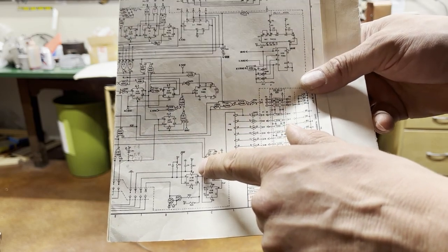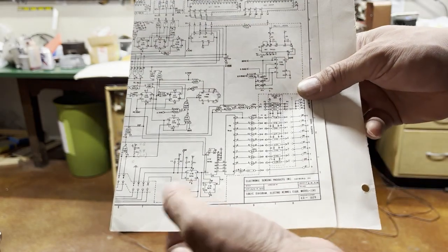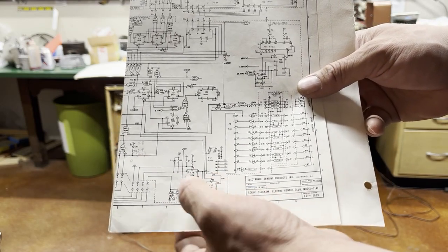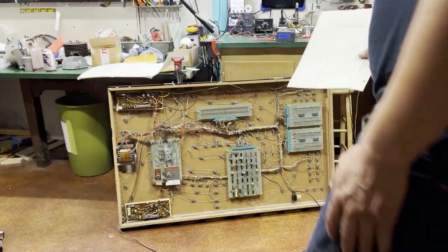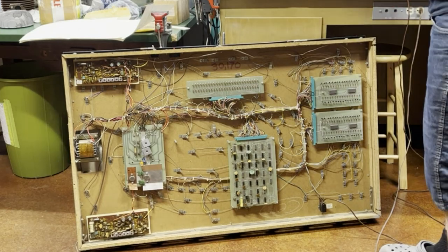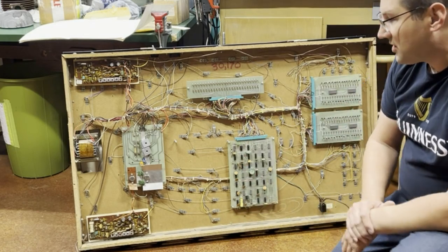I also noticed there's an additional resistor bridging over C4 — even though it was 1R11 — and I wasn't getting a proper low or high; it was not fully pulsing, but it does work. I didn't pull anything out; I don't know if that was a factory mod. I ended up using a simple logic probe on normal settings with pulse mode, and I just checked that chip out. That little chip was the problem, and luckily I had a replacement laying around.